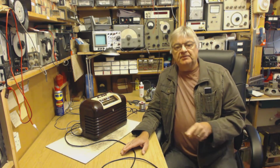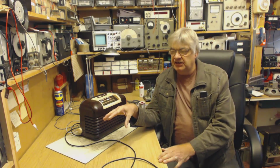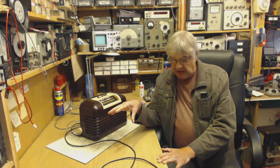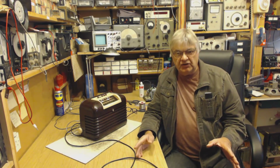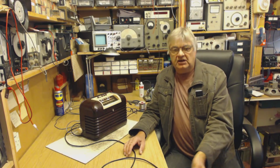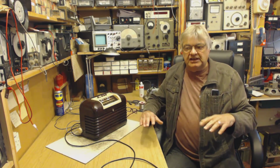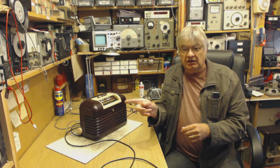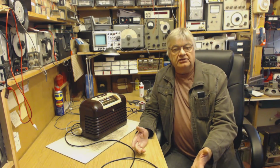Right, there's another problem. If you live, as a friend of mine did some years ago, next to, say, an industrial estate, he lived next to one in Lancing, up the road. He had a good earth system, not the house earth. He made his own RF earth in the garden, lots of wires and stakes. Whenever he connected his earth to his amateur radio equipment, the general background noise level increased. You can watch, I've watched him do it, the S-meter increased the background noise. Where was all this coming from?